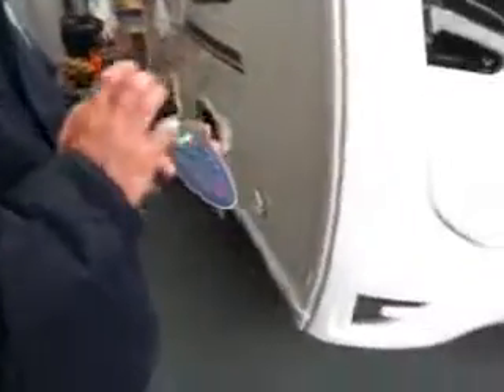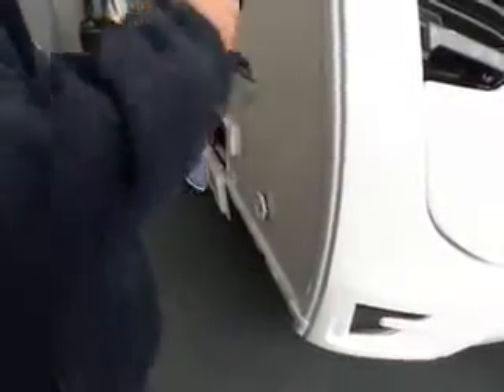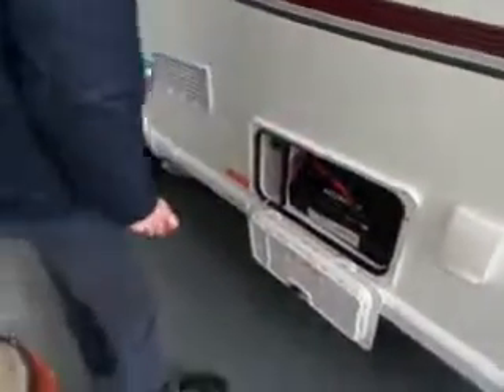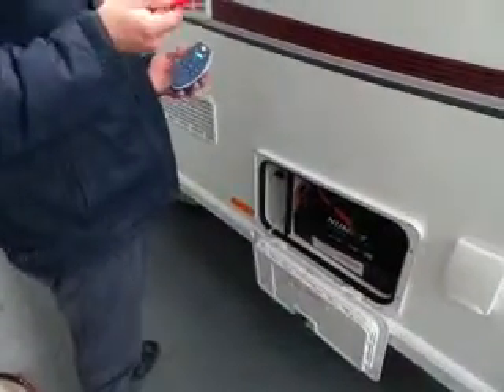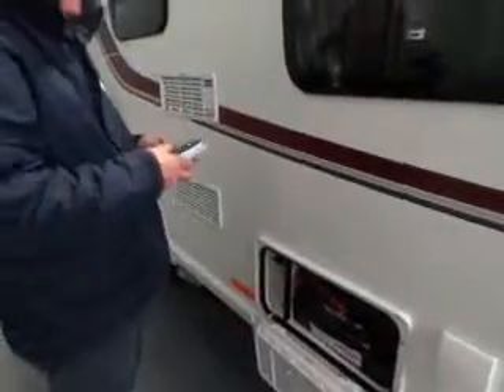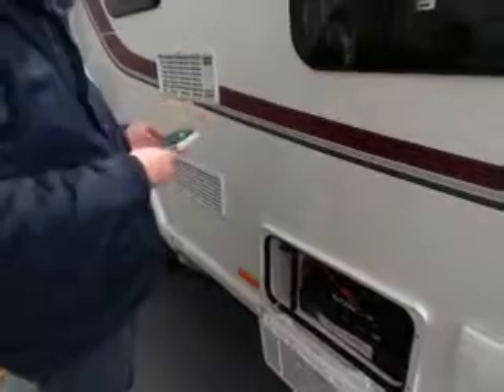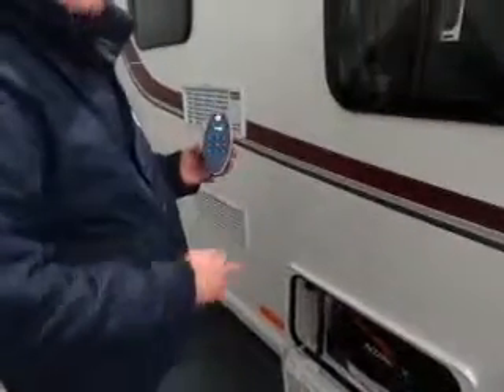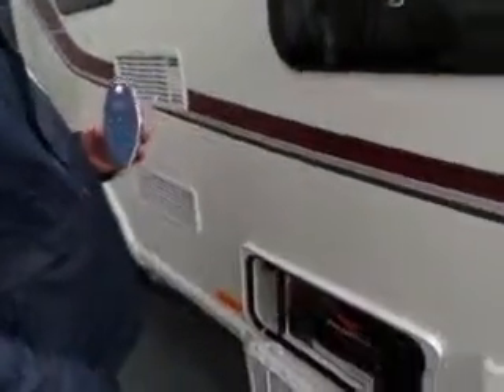Once it's on solid green, it's okay to isolate it and take the key out. If you accidentally knock the buttons, it can shut itself down. If that happens, turn the key off, take it out, give it a few seconds, put it back in and it should reset. Don't leave the key in when you're finished — it will shut itself down. To switch off the handset, it will shut itself down after around a minute for battery saving, or press both green buttons.